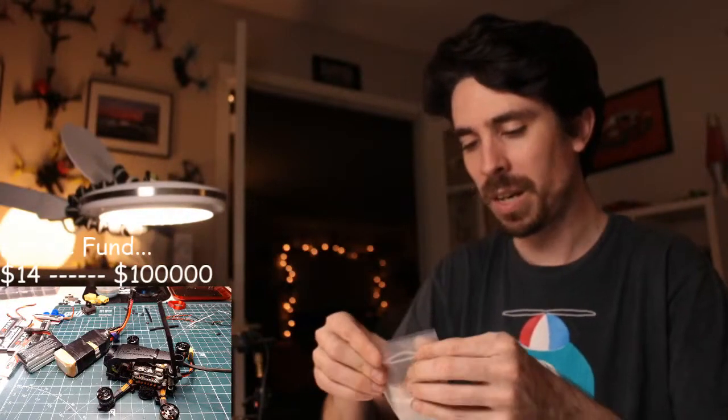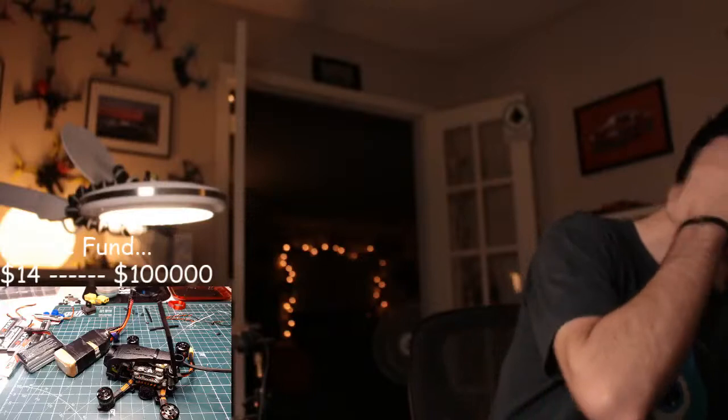So Krunked, if my build was all angry with thrust linear at only 25, what do I need to go down to? Like 20, 15, 10? What are values that you've seen that have worked for thrust linear thus far? Because at 25, it was a mess. Every time I would arm, it would just sit there. Like, whoa, okay. Easy, big fella. Which makes sense, because it's raising the authority at low throttle, of which idle is quite low throttle.